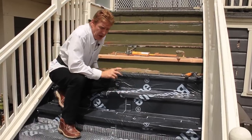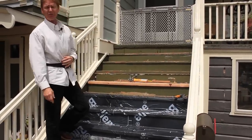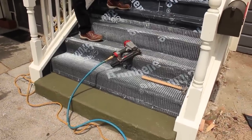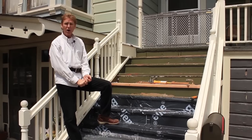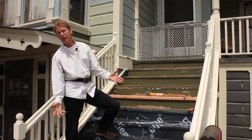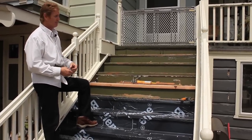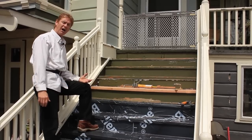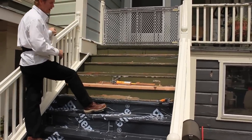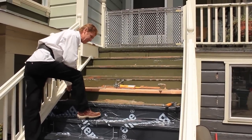What we've done so far is two days ago I pressure washed this and all the paint came off. He said, 'Wow, I used some crappy paint, didn't I?' I said actually, dude, you used great paint. This bottom step is concrete. I used 3,000 PSI with a turbo tip and couldn't pull any paint off the concrete step. I said the wood is what failed — because the wood heats up, expands, and contracts. It's right here in the sun. So I pressure washed it and then yesterday I came and put some caulking in all the big gaps to correct his carpentry.